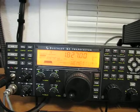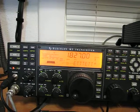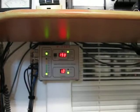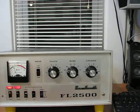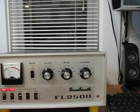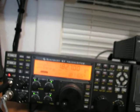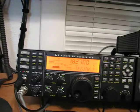But then when you put the power up, watch the SWR meter on the K3 — it goes clear up to three. I've got 200 watts drive and I'm not even tweaking it. The amp is responding fine, but the SWR goes nuts on the radio. I've tried different pieces of coax and it produces the same result.